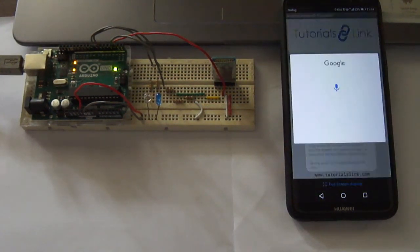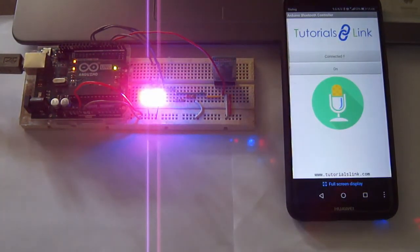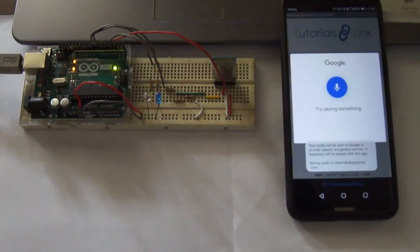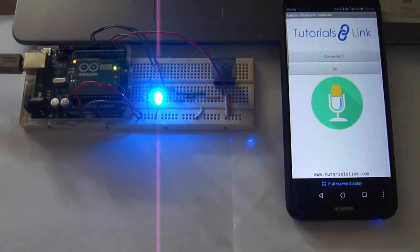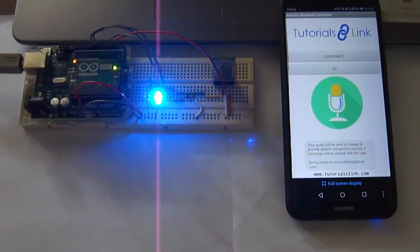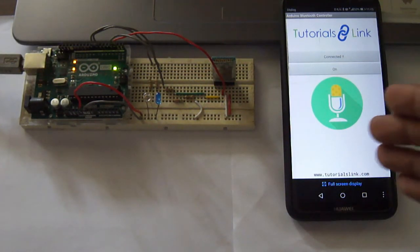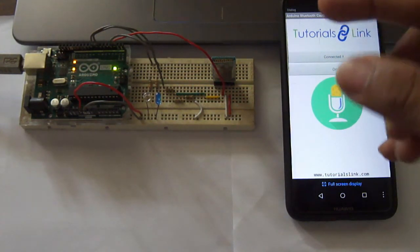Using the voice mode, you click the mic and give the relevant command. Commands demonstrated include 'All LED turn on' — both LEDs turn on — 'All LED turn off', 'Blink', and 'Stop blinking'. A disadvantage of voice activation is that the spoken command can be interpreted with different punctuation or different uppercase and lowercase letters, so you have to account for that when coding the commands into the Arduino.